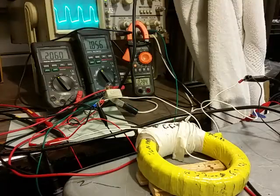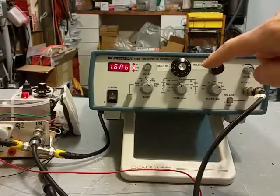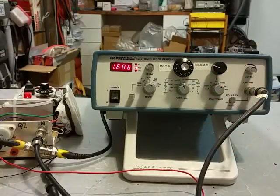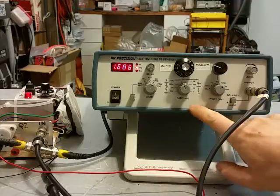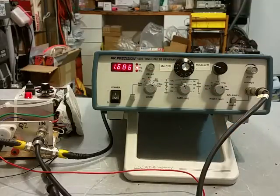This is an update on the over-unity magnetic experiment number one. We're pulsing it with a pulse generator — BK 4030 — sitting on 500 microseconds for the pulse width, and the rate is sitting at 1.6 kilohertz. This transformer is only a 60-cycle toroid, but it will go up to higher speeds without an issue.